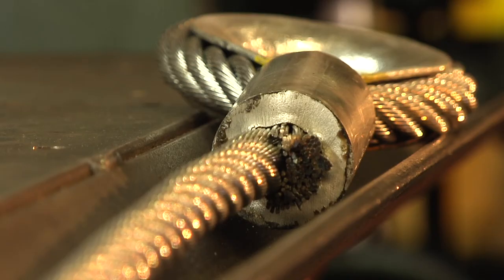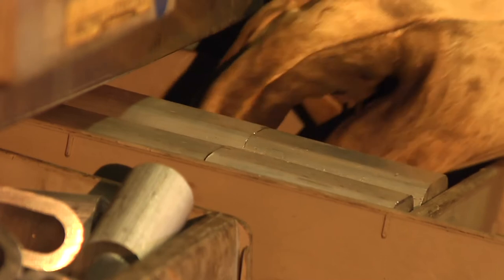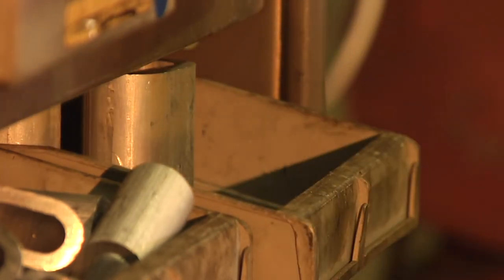For eye fittings and sling terminations, always press in accordance with the manufacturer's instructions. If you are unsure, ask management first. For steel swage fittings, a swaged reduction greater than 14% could shatter the die and result in injury to the operator.